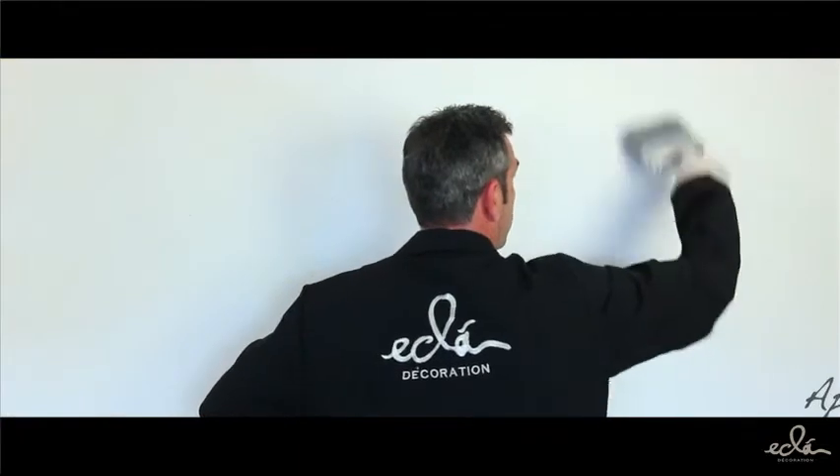Preparation of the surface: After carefully cleaning and filling the supports, apply a coat with a brush of Fashion Fix diluted 1 to 3 with water. In the case of surfaces that are particularly flaky, apply a good coat of Fashion Fix diluted 1 to 6 with water. Apply the diluted product with a brush in one coat to complete the impregnation of the surface.